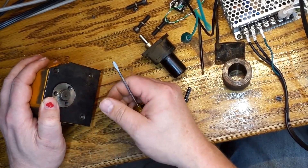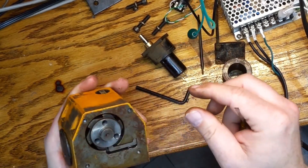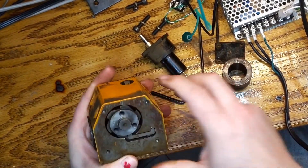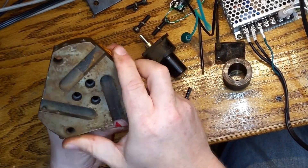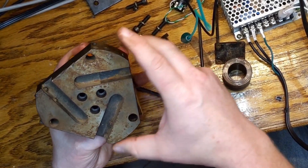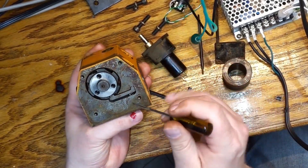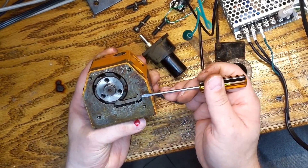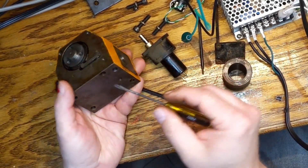So there's what indexes the tool turret. Whoever made this made it too short, so the center is lower than it should be over here — instead of being centered on the chuck when it's indexed, it's actually lower. So they put a shim underneath it to make it right. I think I might modify this and make a new one, then run a set screw through here so you can do a fine adjustment.